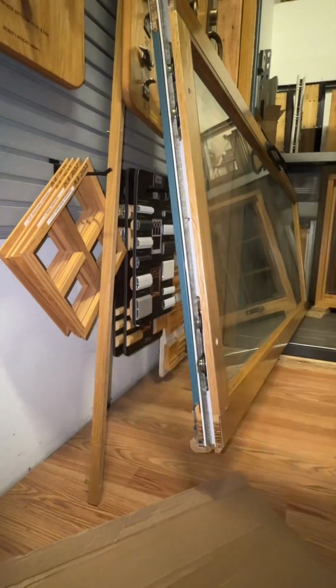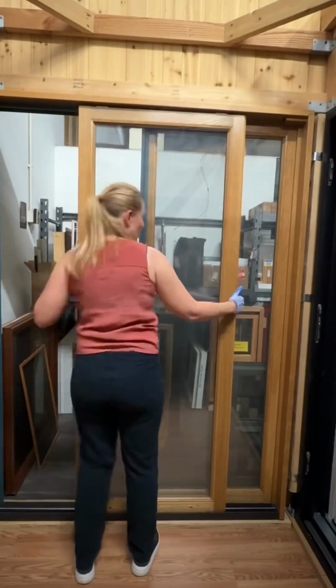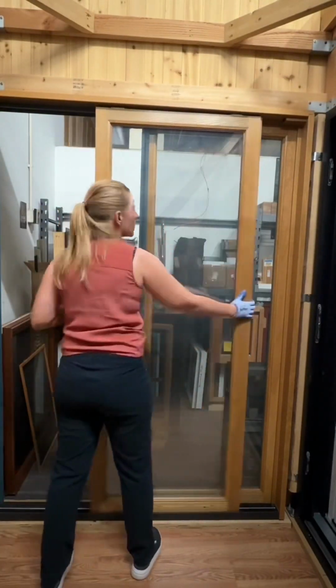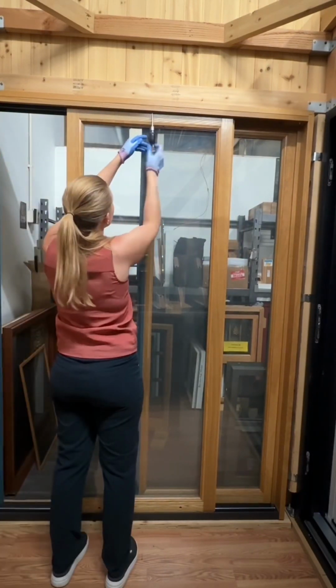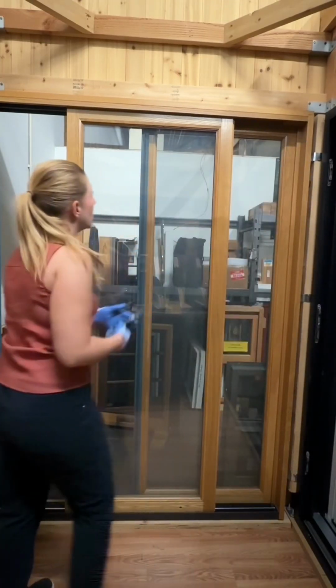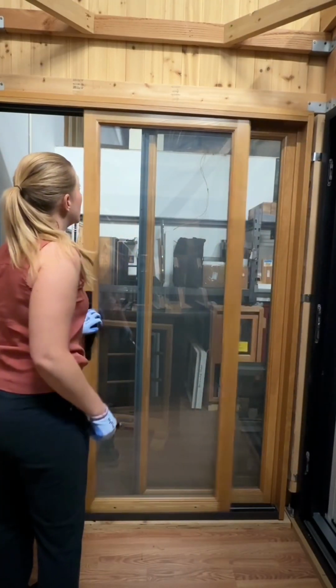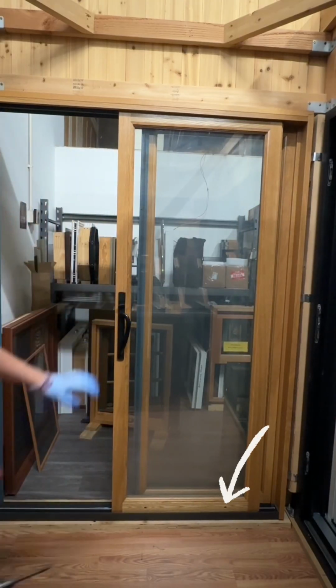Once those are screwed down tightly and into place, now it's just going to be in reverse. We're going to take our door, put it into our track, keep a hold of it so it doesn't tilt out, and then we're going to reattach our top stick that holds it all into place. And now your new patio door rollers have been installed, and now you can adjust them if necessary by access to the 2 small holes that are drilled at the bottom of the door panel.